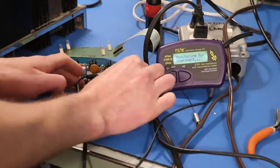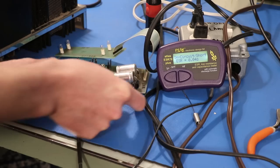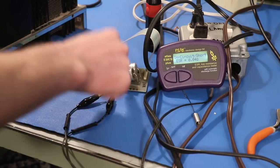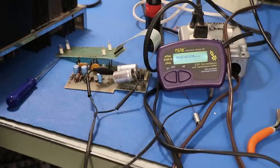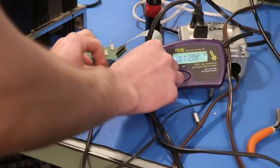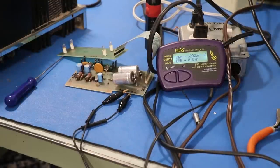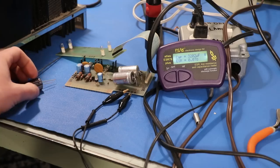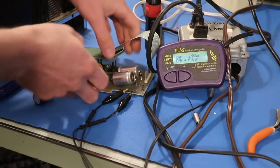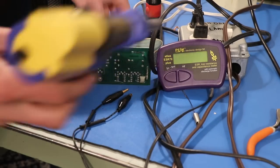Well that was easy. I removed one leg and in-circuit tested it - folks, that is not in-circuit, that's a short. We have a bad cap, so let's get that replaced. We'll replace the other one too - even though it tests with capacitance, this is a 2200-microfarad capacitor measuring at 3200, so something's very wrong. There's just one small issue - this is the only one I have. Let's just replace the one we know to be awful and throw it back in and see if that works.